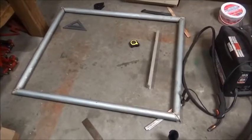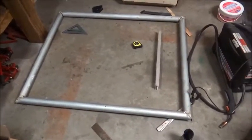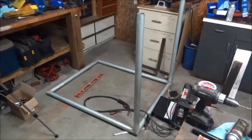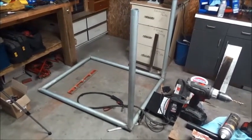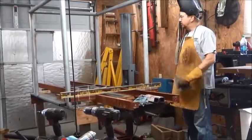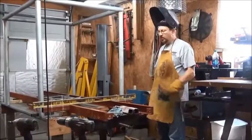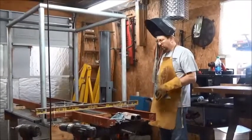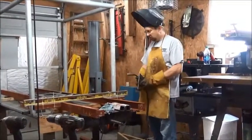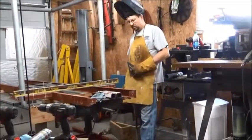This is the basic frame of the body. I'm essentially going to make a roll cage and fill it in with metal — that's the idea — so this is the start of it and we'll just see how it ends up. Getting the upright pieces on now, really having to get everything square and level, trying real hard to make sure I do that. This gives you an idea of the scale — the cab and sleeper are all going to be one thing. I'll have the hood on the front. Right now I'm making body mounts for all this to sit on, using two-by-two square tubing and welding them on here.